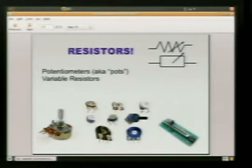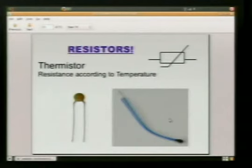They're very useful. And a nice little trick that I would throw out there is that you've got 3 leads. If you're using your potentiometer as a volume control or something, say to dim a light, you're just using 2 of these leads. What about this 3rd lead? Well, let's say we have 2 lights, and we have our potentiometer set in the middle. It's at a 50-50 value. Say if it's 10 kiloohms, we've got it set to 5 kiloohms. If we have this wire hooked up to an LED, and then the other wire hooked up to another LED, it'll work kind of like a balance. When we turn the knob one way, one side will go down to 40%, the other side will go up to 60%. So if you want to do a comparator, this is a quick analog way to do a comparator.